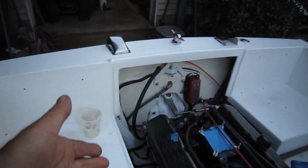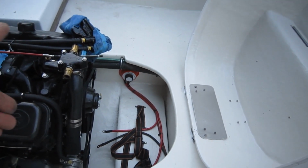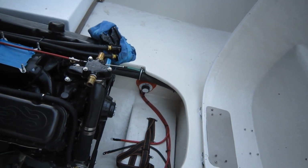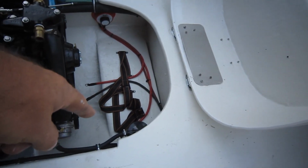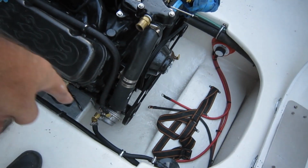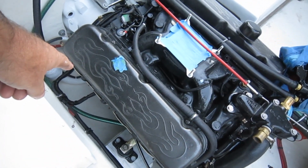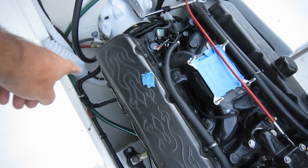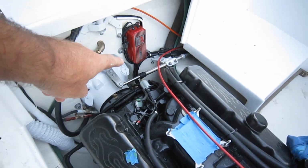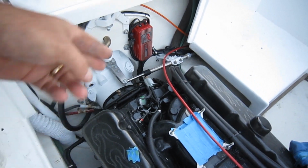Because I left it so, at some point, I know I have this kind of fuel pump system going right now, but as I said a few months ago, if this thing gives me a fit, I'm wiring in right here an electric fuel pump. So that's where the room is for, because if you get rid of this mechanical fuel pump, the room right here is perfect for it. And then it could feed right off the battery terminal off the starter like everything else, and the wire up to the sender, or the pressure regulator switch or whatever it is that allows it at 5 pounds before it'll turn the fuel pump on, goes right there, and then it'll route right back, and the ground goes with it.